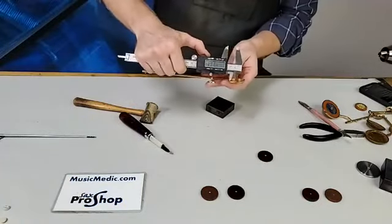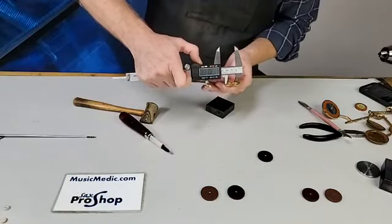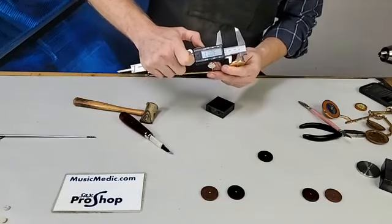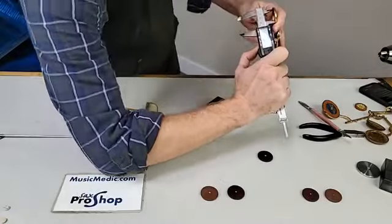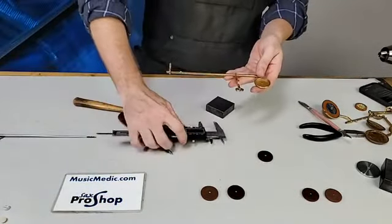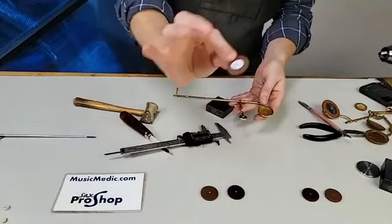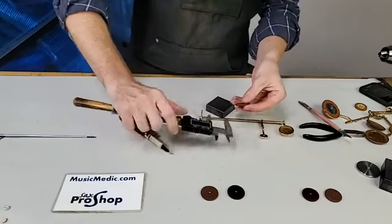The other thing I'll do to check to see if the pad cup is round is measure the other way. So you do 12 and 6 and 3 and 9, north, south, east, and west, so you get all those. And this is saying 30.06. So that to me is a round pad cup, and that's why this is the 30. Can you measure that pad for them too? Let them see that.